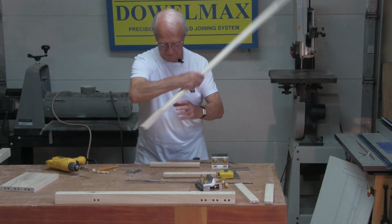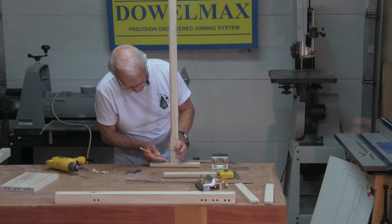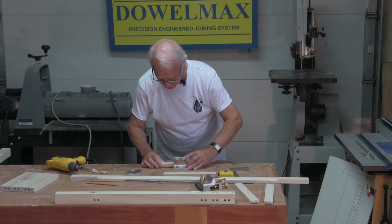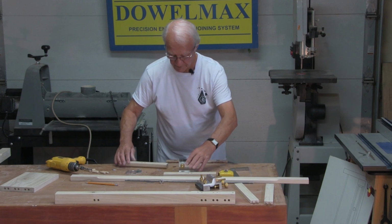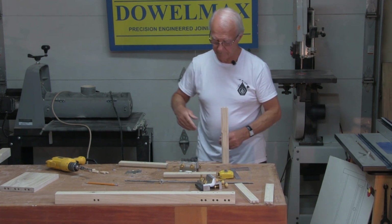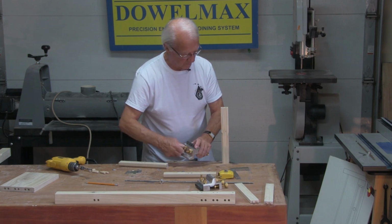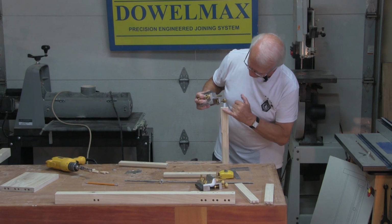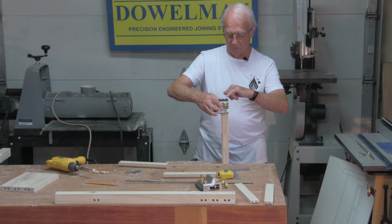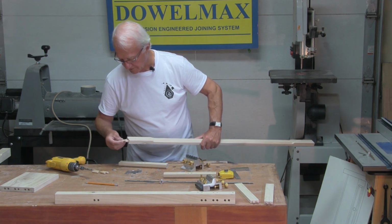First of all, I'll show you the reference marks. Reference marks are here. That reference to there. I've got 1 here, 1 there, a 1 there. We've got a line here, so we don't need that. So put this onto here, bring it up to the line, and drill 1 and 2. And then to do the opposing one, take out the spacer. This is just 3/4, so we don't need it. So there's your reference mark here and here, so there and there. Tighten your clamp screws and then drill through 1 and 2, and that's that. This makes up a very strong tie bar.